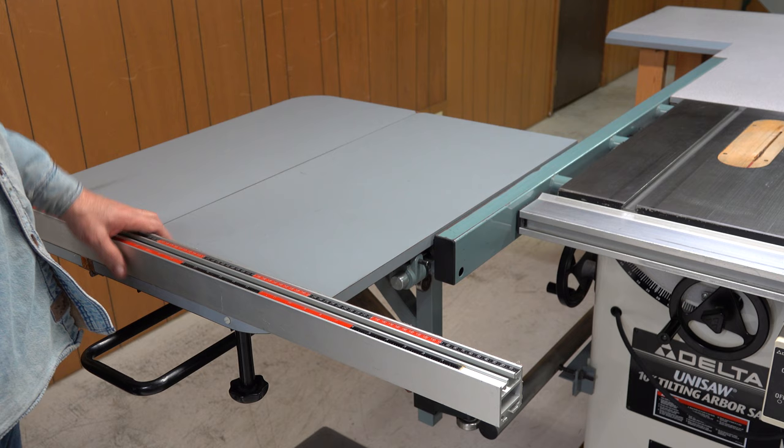Number 22 is the tenon maker. Now, for those of you who are new to what a tenon maker is, I threw together a little sample here. I cut a left side, a right side, and I did one up the middle. But what this does is it takes a board on end and fastens it in for you. Now, if you say, well, my board's too long or too wide, well, this does adjust. And you can now put the clamp closer to where you need on a bigger piece, okay? This thing will also tilt. You can adjust it in and out just micro amounts with really nice adjustments.